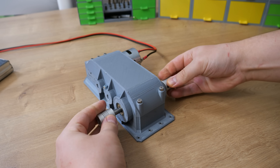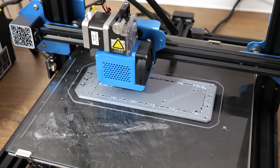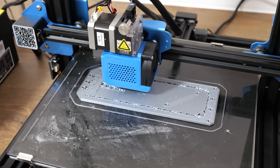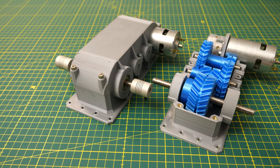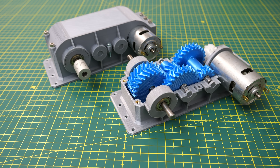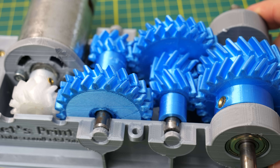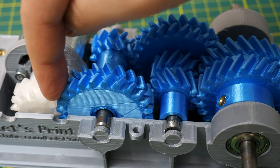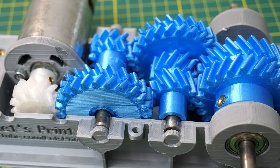This is the old one and this is the new one — looks pretty similar, but it's 3mm longer. The gears are now true double helical gears, not herringbone gears anymore. The extra 3mm is actually what fixed all my previous problems — I basically added 1mm of clearance between every gear pair. Now the gears have more clearance and don't smash into each other so hard.